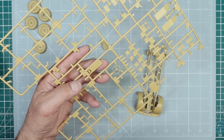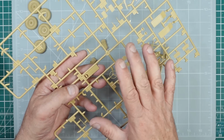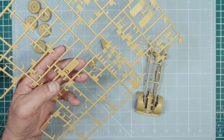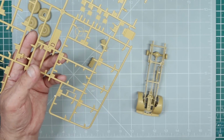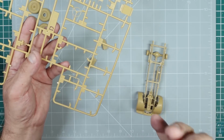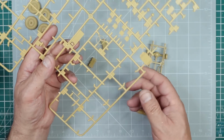The other thing is you've got the volume, so the manufacturer will know the volume of plastic they need to make one sprue, so they inject that much plastic as quick as they can, and close the tool with as much force as required so you don't get any flash. So you don't want flash, which is where the plastic leaks between the two mould halves, and you don't want short shots, which is where the plastic doesn't reach all the crevices of the mould.